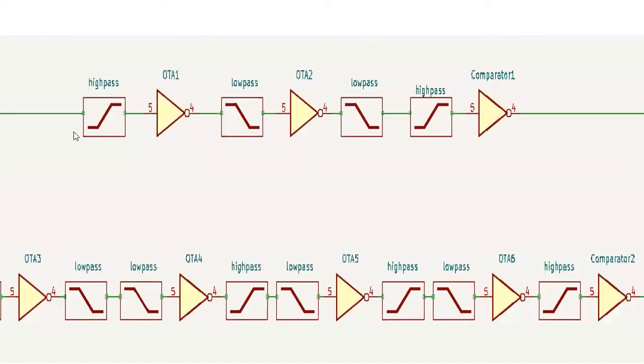Basically, our system is composed of a sensor, a signal processing chip, and an Arduino board. The sensor is composed of an infrared LED and a photodetector. The sensor will output a weak voltage signal that includes heartbeat, respiration, and noise information. After receiving the signal from the sensor, our chip will carry out signal processing.